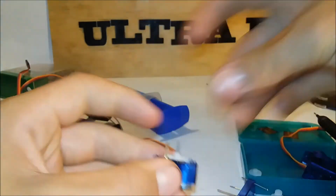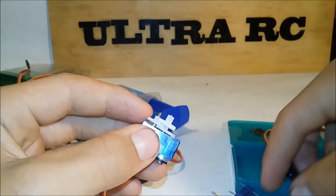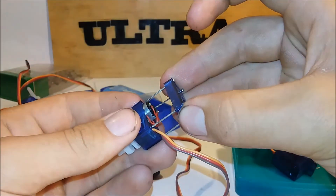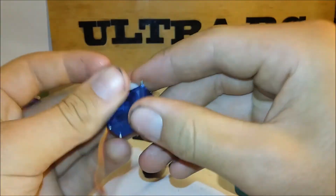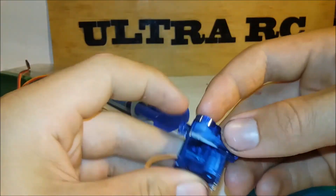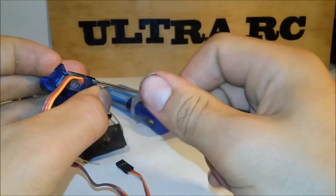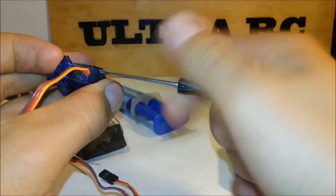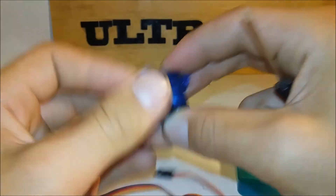Put the second little one, then the third little one, and finally the end one. Then you put all the bits on — put the box right around like this, and then the end bit, and then tighten it up again. And then what's going to happen is when you tell it to go, it's going to keep going and it'll never get to its destination. So you've got a continuous rotation servo — easy as that.